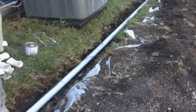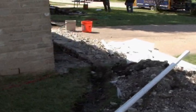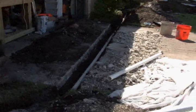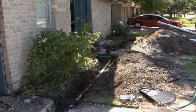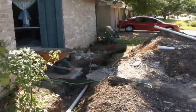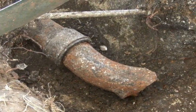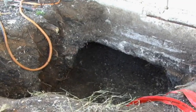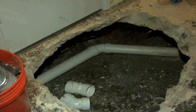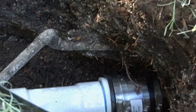What they've done here is trenched and they're going to lay new pipe in that trench, trenched all the way across the driveway. We like to trench where the seam is, and we're sending all new pipe all the way down to the main sewer line. Here is the main sewer line — they've disconnected the side going to the city, where they'll actually reconnect it in a minute, and this is the side going to the house.